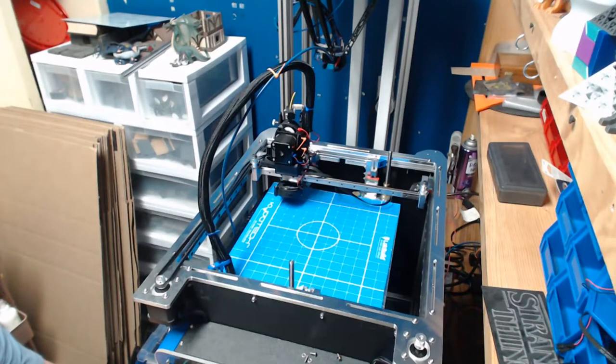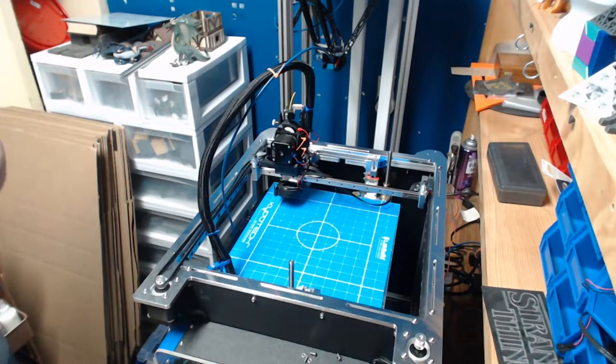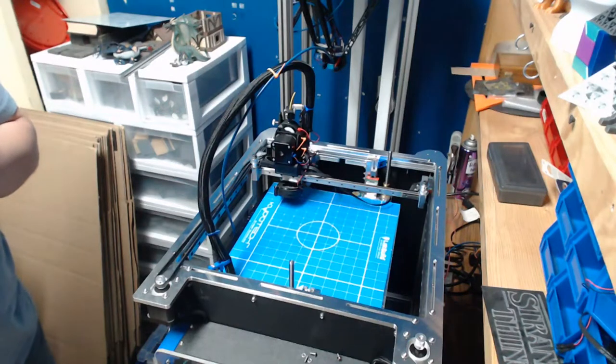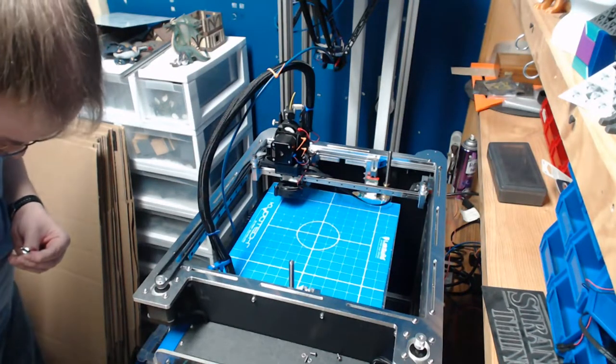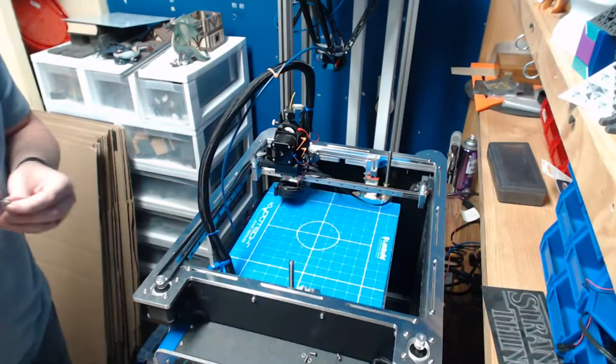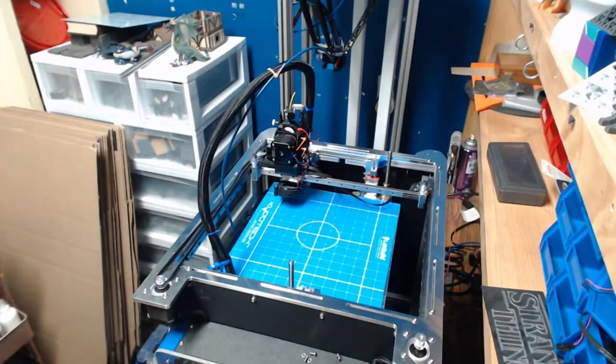Okay, I know I have 12 millimeters here. Those are all the same. Oh, I have calipers right here. Let's check. Yeah, that's a 12 millimeter shoulder bolt. So I think I need to take 1 millimeter out with a washer, put one shim above, and a pulley. Preferably a pulley that doesn't feel like there's sand inside of it. Shim below. This must be terribly exciting. See you, Greg. Thanks for joining for a while.